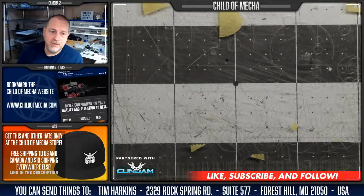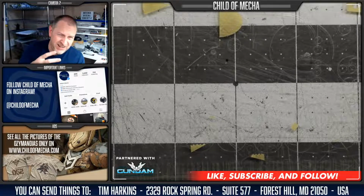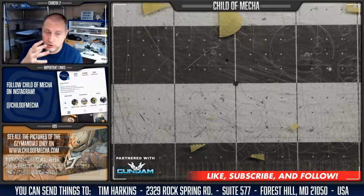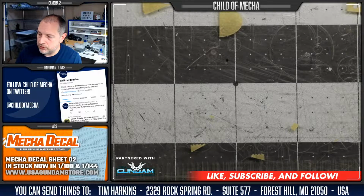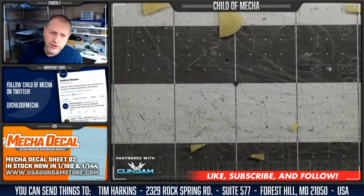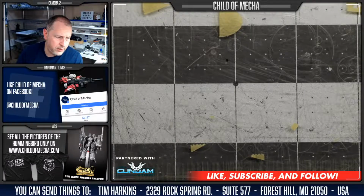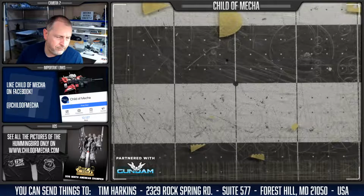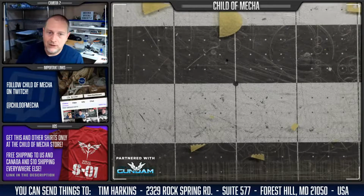But what I find is that the dust isn't that bad, and if you do happen to get a piece of dust fall on your part as it's drying, and mind you, this is lacquer, so the chances of that happening are very, very low, because it cures super quick. It flashes very, very quickly. So I don't worry about dust too much when the parts are drying, curing, whatever you want to say. It's more in spraying. The dust will fly in the path of the spray and plaster on it.